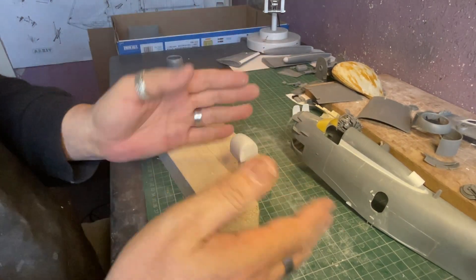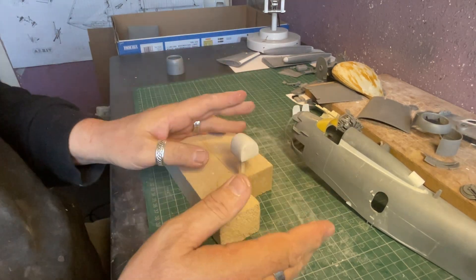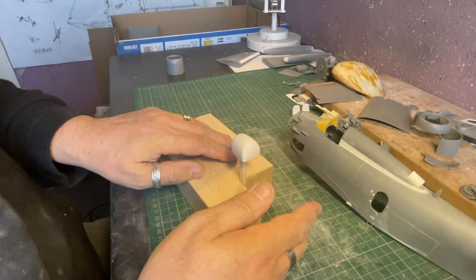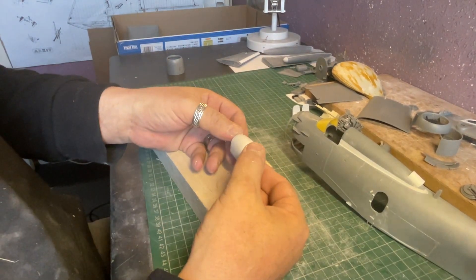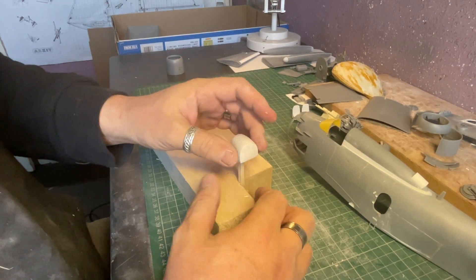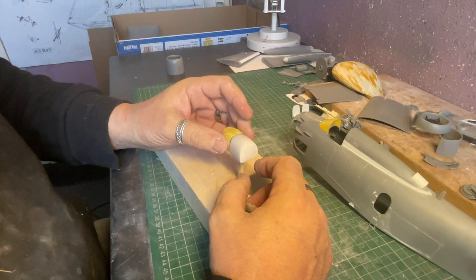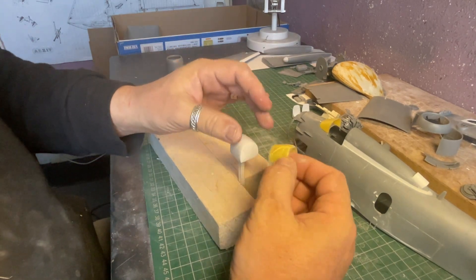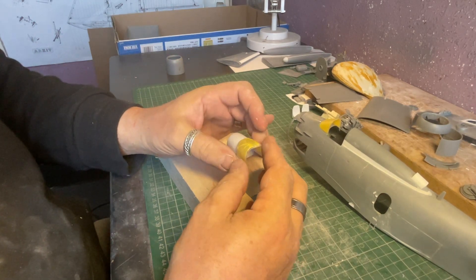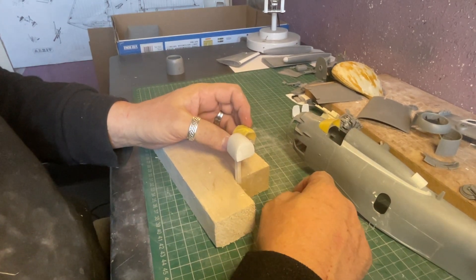I added a little bit lengthwise because when you do plug molding or vac forming, if you have something exactly the same length the radius of the plastic ends up being part of the component you need, so you need to get that radius curve out of the way. This component is about one and a half mil each end — in total about three mil longer than the gap. It's a little bit fatter than the original canopy at the front and at the back, which will give me a better shape to fit in here.